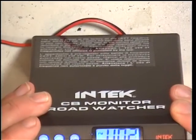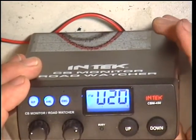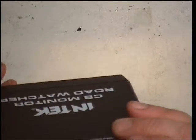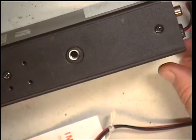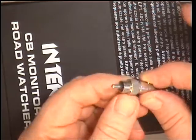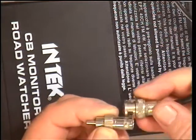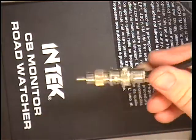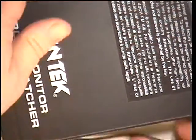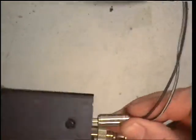Right, so we're going to put it on channel 20 to do our normal test procedure. And all we need to do now, I've just realised, is to find a phono adapter so I can plug the test instruments in. So we have a phono to BNC - our test instrument is terminated in a BNC - so that will now go in the socket. And plug the test instrument into the external socket.